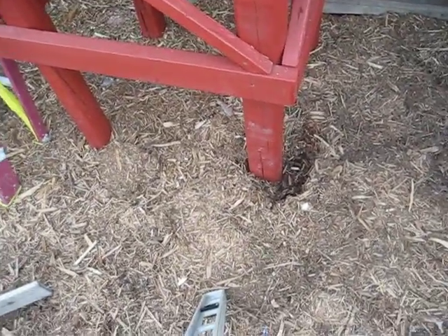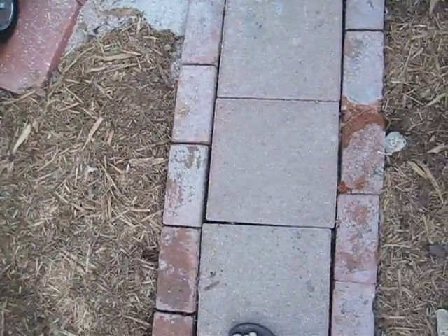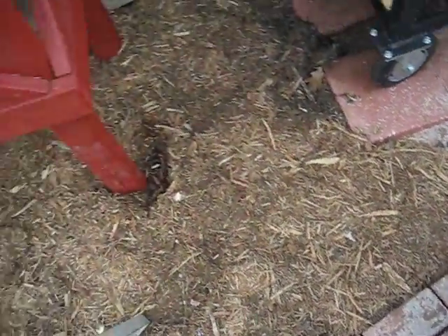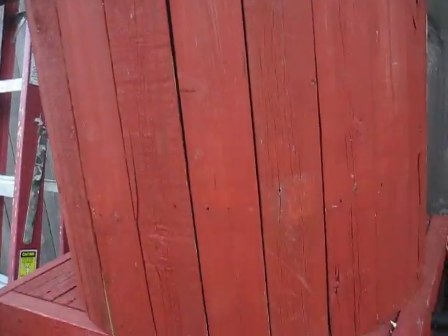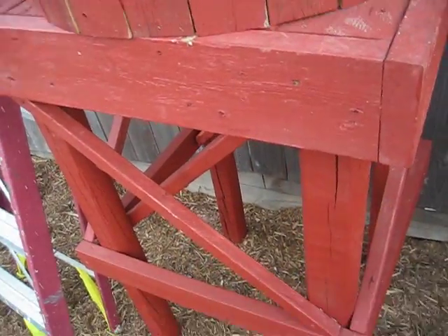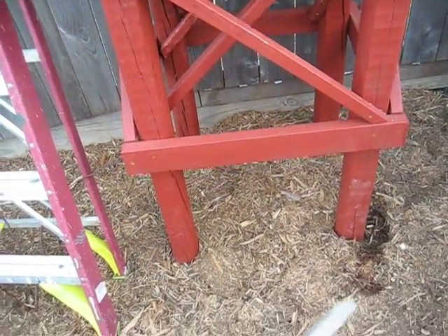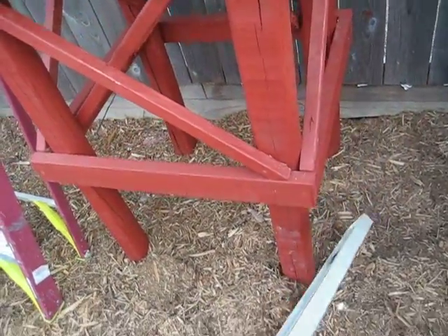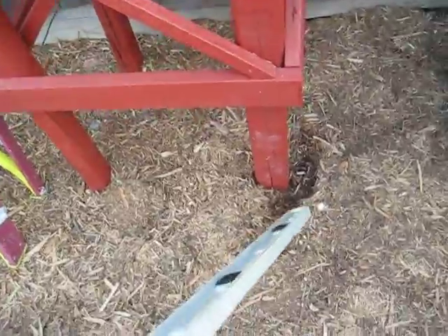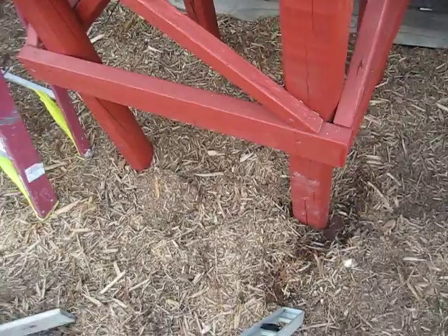The tower is actually sitting on 12 inch by 12 inch cement blocks, such as what you'd build a sidewalk out of. When this thing is full it's going to weigh about 260 pounds, so it needed to be sufficient in size. You'll notice that we have a two by four circling all four legs to hold them in place. We're sitting level on 12 inch blocks.